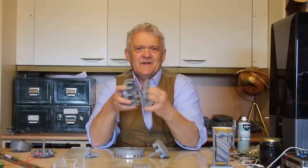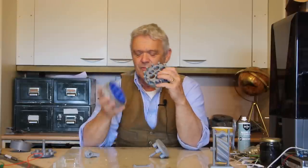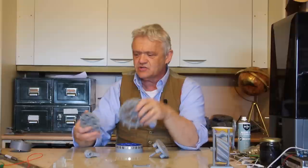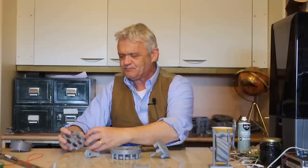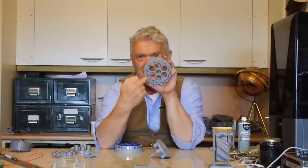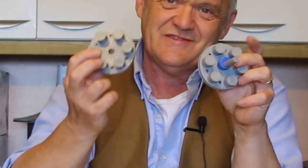If we take this one apart we have the pins and the lobes sitting in the center — so we've got exactly the same thing. But instead of having lobes, we've got two distinct circles and a bunch of magnets arranged around them. When this works, what it does is turn a cam — and the cam is right here. There's the cam; it's got a little cam on it and that cam turns, making it move around in a cycloid. This has exactly the same thing: a cam, and then the output plate — they're identical. So I've made a magnetic cycloid gear train, and there it is.